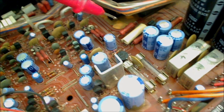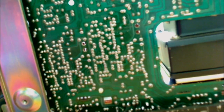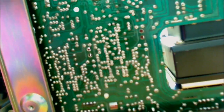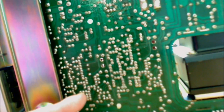What I'm going to do now is flip this unit up on its side carefully, because this thing weighs a ton. I'm going to find out where it's connected at the bottom of the board. It's not as difficult as you think. I'll remove one of the legs of that metal oxide resistor to get it out of the board so it's not affected by the other components it's connected to. I have a solder remover here and I'll remove the solder and lift up a leg.